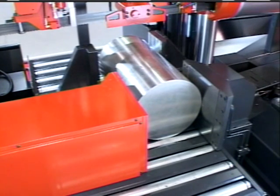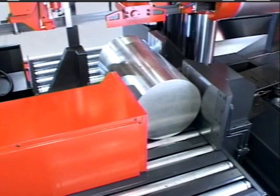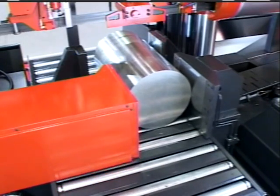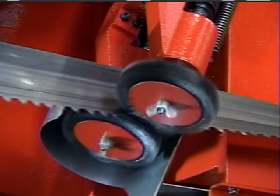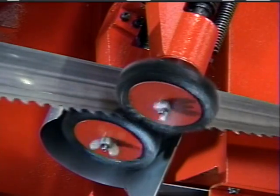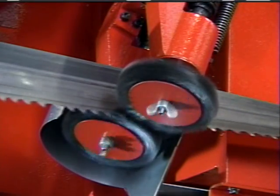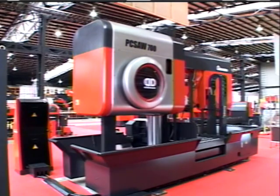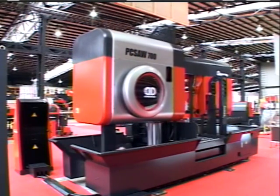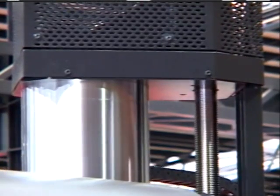This is the material indexing mechanism. Positioning of large, heavy materials is easily attained by the combination of front and rear vices. The tried and proven dual wire brush system maintains a clean tooth gullet area. This is the blade quick approach bar for minimizing time between indexing and cutting.